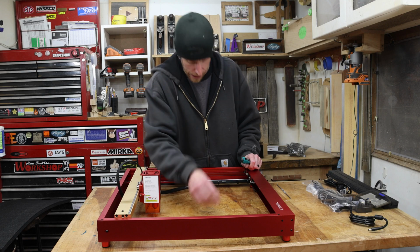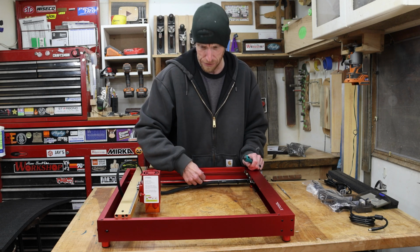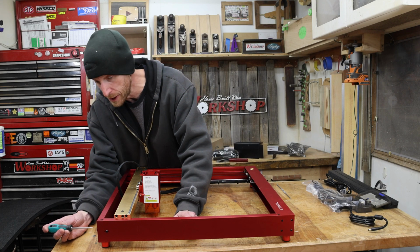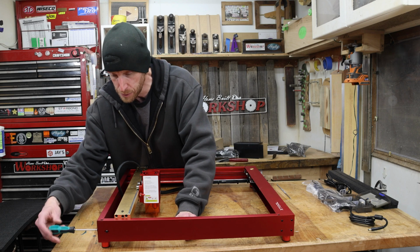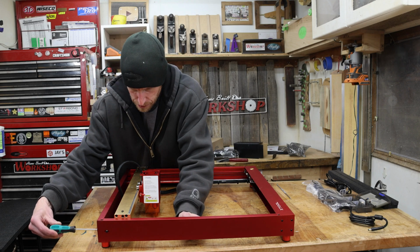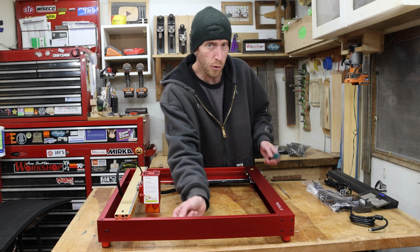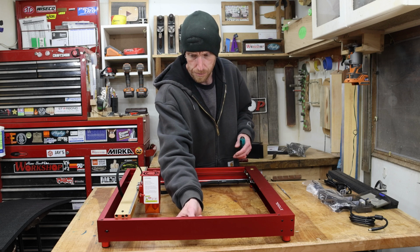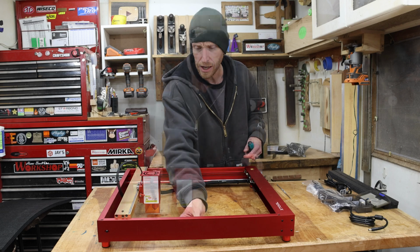Now we need to set the tension of our timing belts. As I'm checking them, really, they feel about the same. This one over here may be just a little bit looser. So I'm going to tighten this screw that we put in that threads into the tensioner. I think we're good on those belts. You don't want to get them too tight or you could stretch out or break the belts. But I don't want them to slip either. I think that's all right.